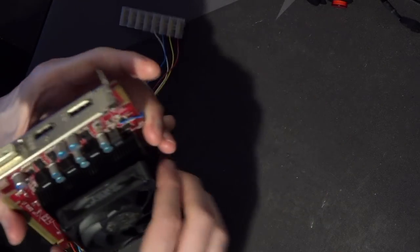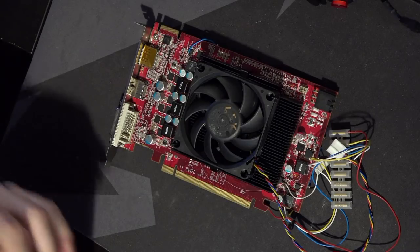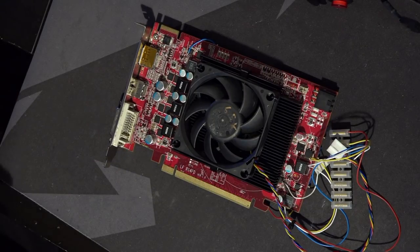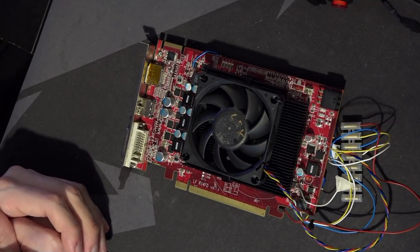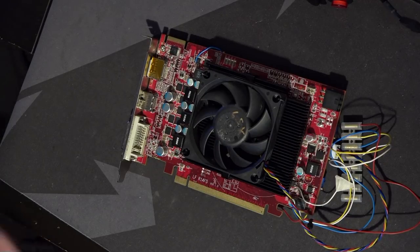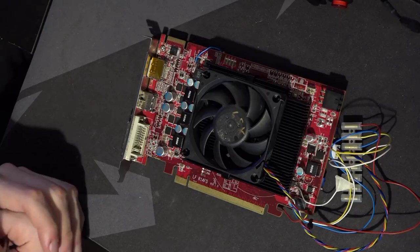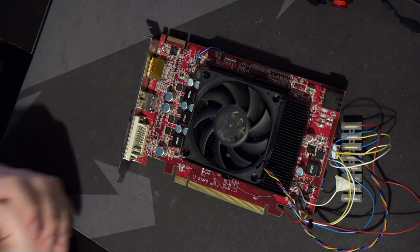That's it for the video — that's this 7770 here. The main thing is you just need to overvolt the memory controller, and then these things pick up some speed in terms of memory. Thanks for watching, like, share, subscribe, and leave any comments, questions, or suggestions down below. If you'd like to support hardcore overclocking content, I have a Patreon — which is honestly how I get my hands on cards like this, since I have poor self-control and walked by CEX and saw a 7770 for 25 quid. There's also the AHOC Teespring store where you can pick up shirts, stickers, and posters. Links to the Patreon and Teespring store are down in the description. Thanks for watching, and goodbye!